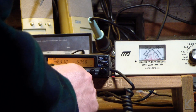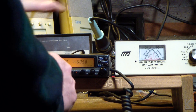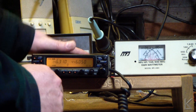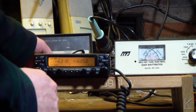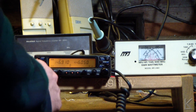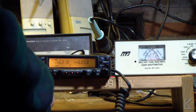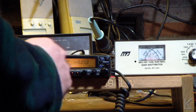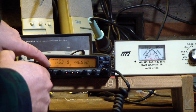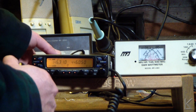I've got it hooked up here on the bench with my meter and a dummy load. The fan comes on when you go into transmit mode, which is normal behavior, but we're not getting any power out. I did a little percussive maintenance and got it to go in and out. Oh there it is — 30 watts... okay that's about 10 watts, I'm on the 30 watt scale. Now we don't have power — it's going into transmit mode but we're not getting power. I can see the needle jump a little bit. I think we've got an intermittent connection.